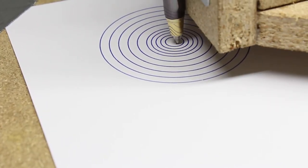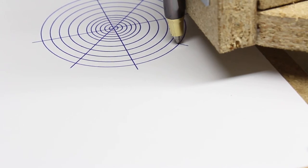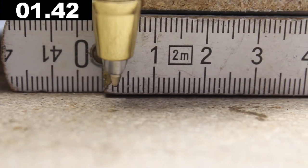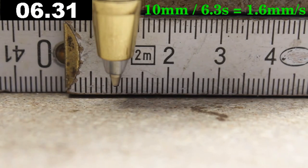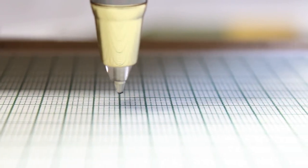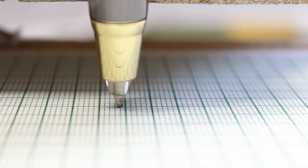A test pattern is plotted with a ball pen on paper, consisting of some concentric circles and four lines arranged with an angle of 45 degrees between two paths. The plot is compared with the pattern printed on a foil using an inkjet printer. There are noticeable deviations, but considering the simple construction, the result is not too bad. The maximum speed is just around 1mm per second — patience is required. When moving the pen to one point from both directions, you can determine how precisely the drive is adjusted. The error is just a minor fraction of a millimeter.